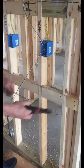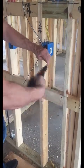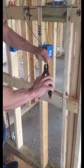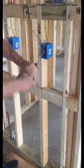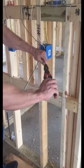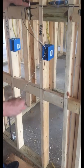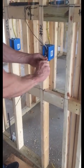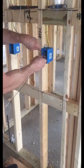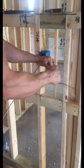Since you're actually connecting outlets here, you have to do what's called a pigtail for the grounds. That's one of the reasons why you like to leave the wires long, so you have a longer piece of ground wire available. You tie these together — you twist it like that, keeps it all nice and neat — then take a wire nut, attach that, and push it back in there out of the way.